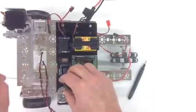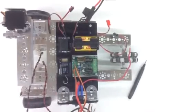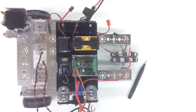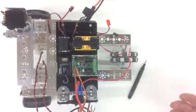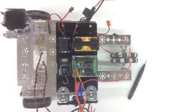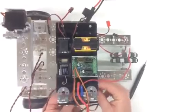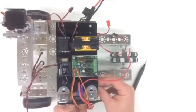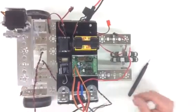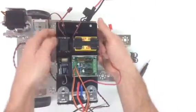Good — now that it's through the deck, it's safe and won't get into the gears. One of the most important things when creating an electrical system is to keep everything neat as far as the wires are concerned. With these Tetrix robots there are going to be wires everywhere, but we need to do our best. I'm going to take the DC motor wires and feed them under the undercarriage so they don't get into the wheels — we don't want wires shredding in the wheels.